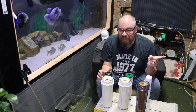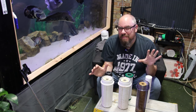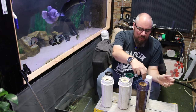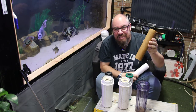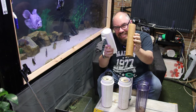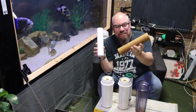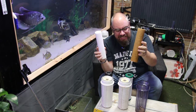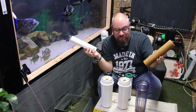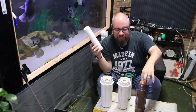I've had a text message from my water company to say they're going to start cleaning the pipes soon, so I'm getting ahead of the game. These have been in for three or four months at the outset. I'm just changing them to make sure that I've got the most protection for my water. But if we compare the first filter — this is the sediment filter, a five micron sediment filter — in three or four months, that's what it's pulling out of your water. Why wouldn't you use this? It's pretty grim. It doesn't smell or anything, but it's not great. I know a lot of people have started using these. You can get house systems with bigger versions so the water you're drinking is nicer — because it's not treating the water, it's removing things from the water.